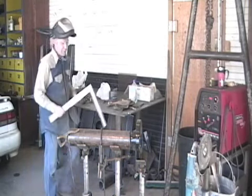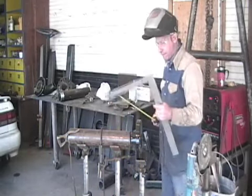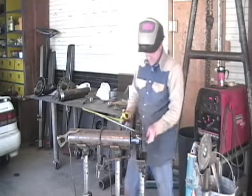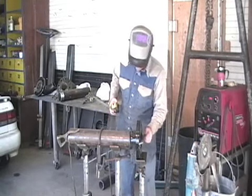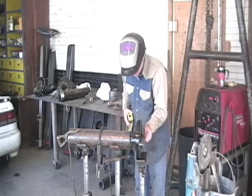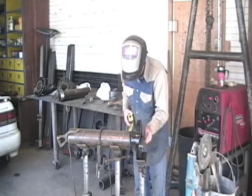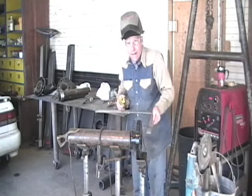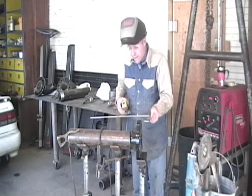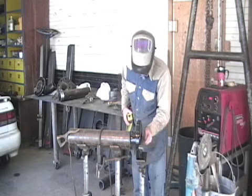I've got an aluminum 2-foot square here and a tape measure. You can take a framing square and a tape measure and go ahead and square this off the face of the flange. Make sure you keep that in there, and then just off the center of the pipe somewhere, I can move the square in and out to wherever a precise measurement is. So I can pick just say the 4-inch mark on there.